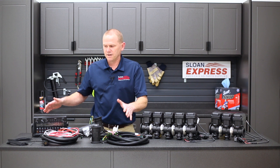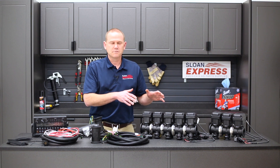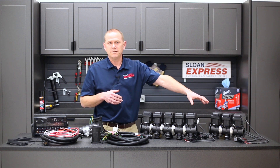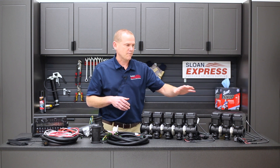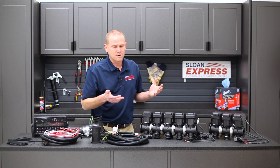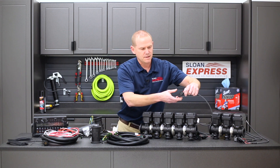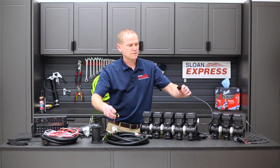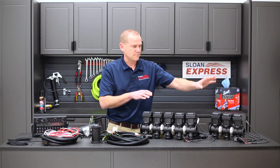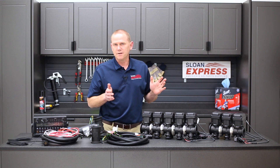This covers what's in the complete kit. We left the valves out on purpose — depending on how big your sprayer or boom is, you may want to only do a three or five section. We've got both of them already here, put together, already clamped. Pretty much all you've got to do is mount them on the sprayer or 28 applicator and you're ready to go. These will already come with the weather pack connection, just like what's on your main implement harness — easy connection. If you need a three or five bank, we have them as separate pieces as well.